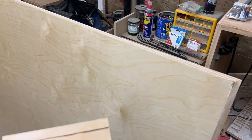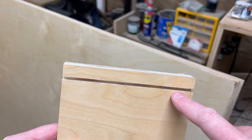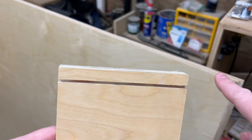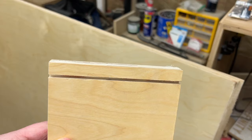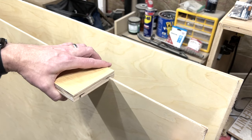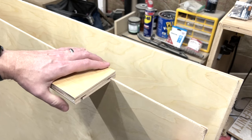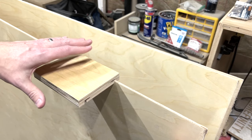I've run all my parts through once including this test piece, so next we're going to move the fence over a sixteenth of an inch and make another pass on this test piece to make sure it's going to fit on my back panel before I run all the pieces through again. Now we've got a nice fit — slides just enough, there's room for some glue, not too snug. So go ahead and make the second pass on all of our parts now.